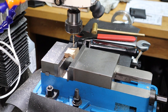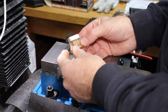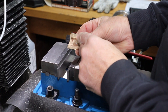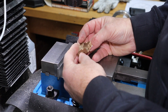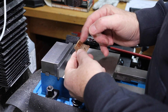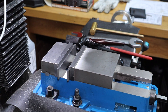That's our starting point. What I've decided to do is cut the bulk of this out with a hacksaw first, and then machine what's left, because it's very difficult to hold in the vice to take out so much stock. If I get the bulk out with a hacksaw, I can take some fine cuts and be a bit safer.